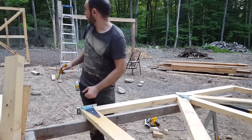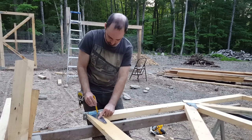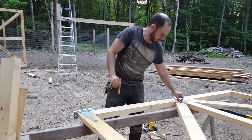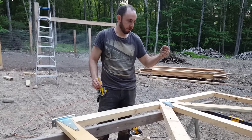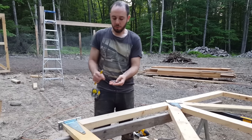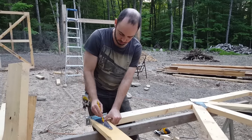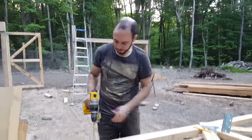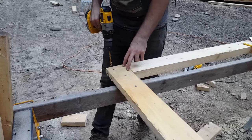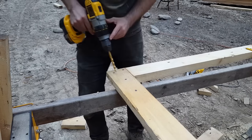I'm going to put two hinges on it — these are 10-inch galvanized hinges. I'll mark all four holes and drill them out. I'm using three-eighths by three-inch galvanized bolts with a lock washer and nut — the lock washer probably isn't necessary because it just sinks right into this soft wood. I need to be careful since I've got screws in this one as well. I can see the countersunk hole here, so I'm safe going through it, and over here I'm off to the side so I think I'm safe from hitting metal.